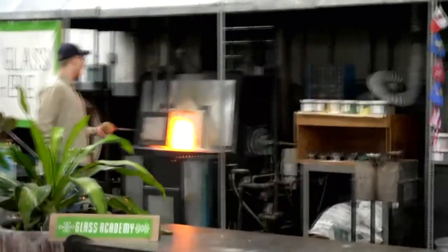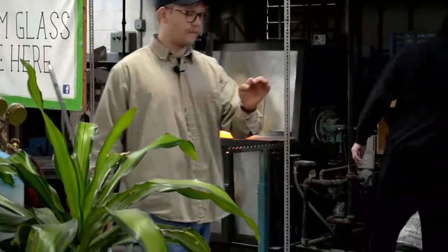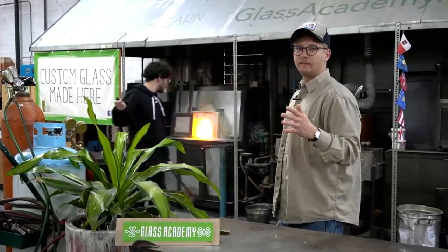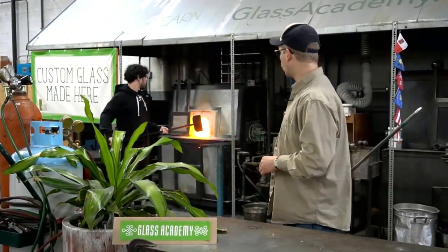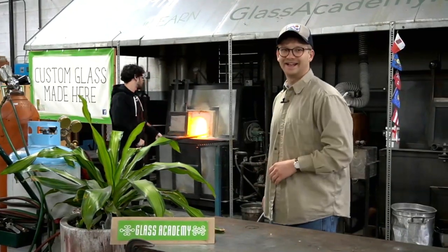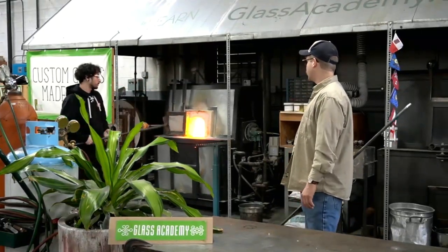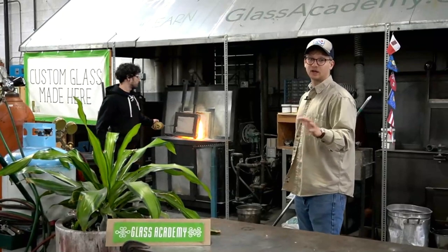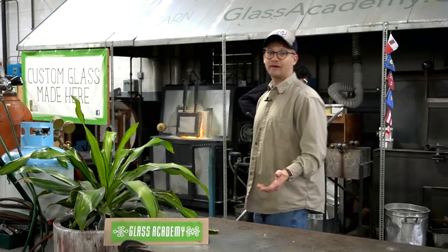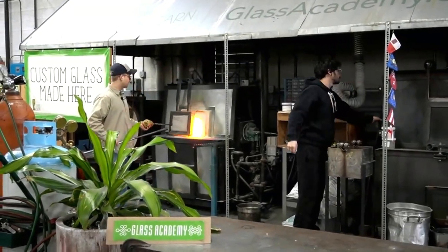We got it. I wish you guys could see inside here because it almost looks like a honeycomb type deal. There's so many perfectly sized little bubbles on top of the glass from all the cullet melting down last night. Basically, when you fill up the furnace from really low to really high — I stuck around for an extra couple hours yesterday and did that — it has all those little bubbles in there and you gather it up and it just causes problems. So Matt just took a big old metal rake and pushed it all to the back.